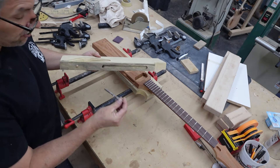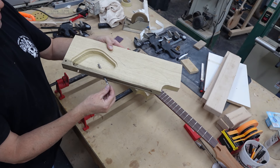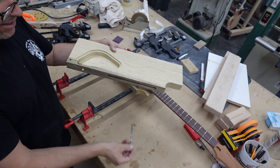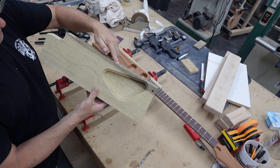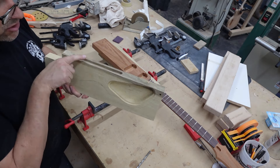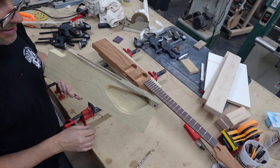Then I drill the hole starting at the end of the cavity at an angle. When I routed my control cavity, I've got wire there. The reason I did it at an angle is so that when I push wire in, it doesn't have to hit a 90-degree wall and then go down. I push it in at an angle, meaning wire will just flow right directly into the control cavity. That's something to think about.